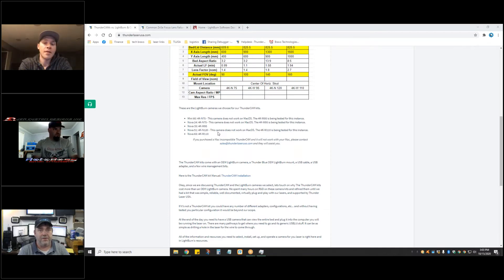The best way is option number three: use Send or Shift+Send to send the job to the controller. Instead of hitting Start and streaming the job, if you use Send it sends to the controller and then starts the laser automatically. That will eliminate any dual air assist sequencing issues permanently.